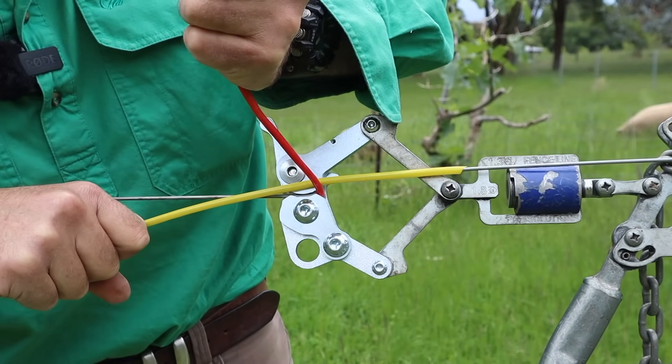We've got our orange knot set up on the test bench. Let's stretch it and see how it performs compared to the unbroken wire. We'll go a bit slower this time and try and get some accurate readings along the way. So we're just starting to feel the weight now, up to about 50 kilos. And what I'm seeing is it's actually extending slightly — so it's actually stretching with the wire. We've got 188 kilos there. This was a really popular knot back when we used mild wire. It's coping quite well though. Just a shade over 300 kilos and it snapped.